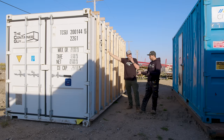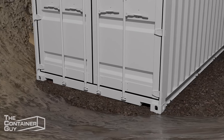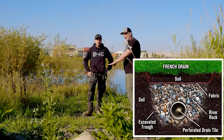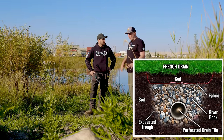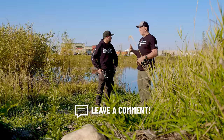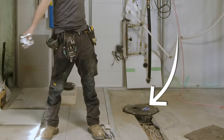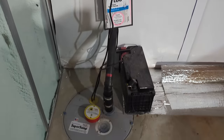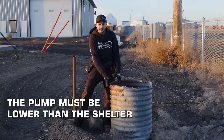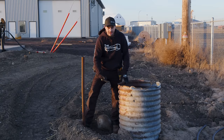An issue we have here is with the floor structure. What do you do underneath there, and how do you deal with backfilling the dirt underneath those beams or channels? Well, we use an engineered rock, and then we do a layer of engineered rock that acts as a natural French drain. Then we'll put a 12-inch galvanized corrugated pipe with a sump pump down the bottom. So if you have groundwater like around the pond, you can pull the water out — it's no different from basements in Canada with a sump pump. Ron mentions using a galvanized pipe as a sump pit — at our new site we use a 24-inch for dewatering. You can see water in it.